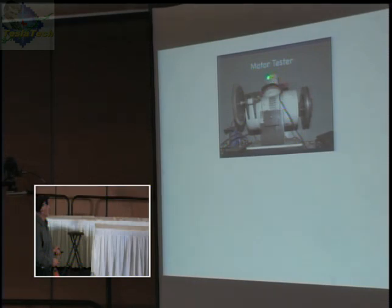This is a coil. I made 12 coils so I could replace the coils quickly. This part here is timing. The thing would rotate. I discovered that the reed switch was very sensitive. You had to have it just precisely timed. This over here is for horsepower, to see how much horsepower it had. This idea came from Peter Lindemann literature, and I learned how to use a spring scale to measure the drag and so on.